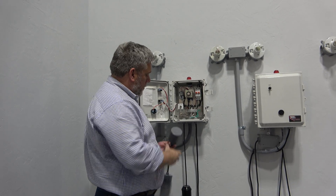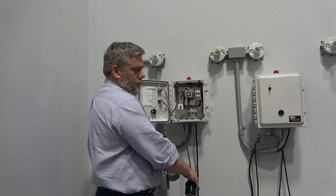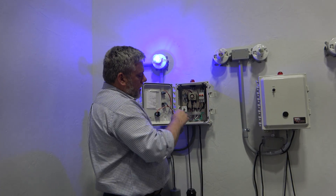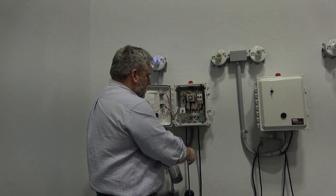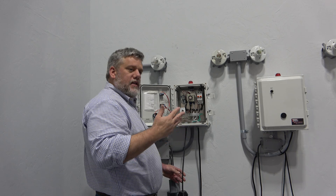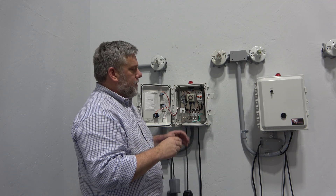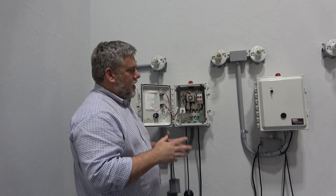Let's say it's off and the water is filling up in the tank and you're going to have a high water event. Generally you'd have an alarm before that, but you'll have this override float. This will kick on and override the system — it bypasses the timer and makes sure the tank doesn't overflow. You'll have an alarm event, which is important, because then you know your system is not dosing how it should. If it's timed correctly you shouldn't have an alarm event, and somebody may need to come out and adjust it so it's dosing enough.